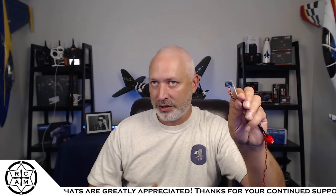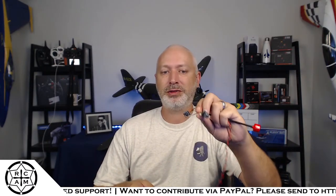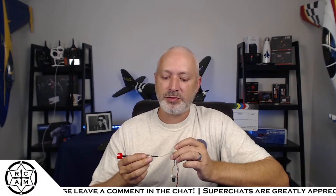It's a 300 milliwatt VTX, so it's a lot stronger than most of the VTXs that are part of an all-in-one camera package, which is why I don't use those. There are a lot of all-in-one cameras out there that have a VTX built into them. I went this way because a lot of those are like 25 milliwatt, and you start getting a lot of breakup, especially if you fly a little further away or accidentally go behind a tree. This will allow me to get a much stronger signal, and I can use whatever antenna I want, where a lot of those all-in-one video transmitters have a built-in or soldered-on dipole antenna, which is a piece of crap.